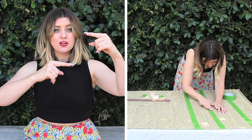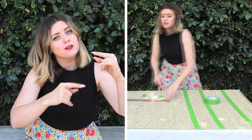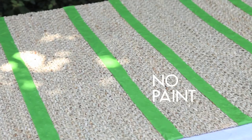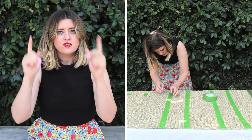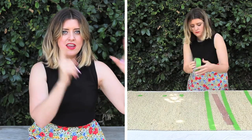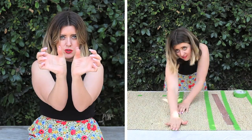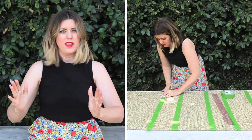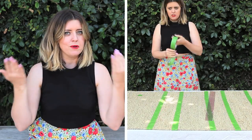The second tricky part with stripes is you have to be very careful about double and triple checking your width. Where you're not painting, the tape needs to be inside — that looks extra narrow — and where the paint is, it needs to be extra wide. So it's not evenly every other one; you have to use the tape and be really smart about the width.